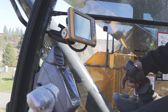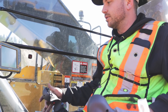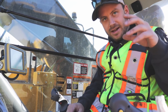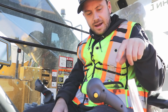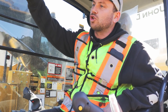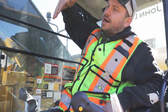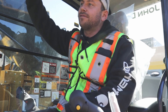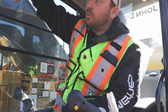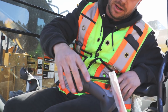You can hold down for the same — change different functions — so it gives you six software quick features. Underneath there's a blue and a red button. Red button is for our offset, so we can offset our design quite simply — red will be down, blue is up — bringing that surface up or down depending on how much you want to cut. On the left joystick we have bucket control: when we're running automatic with bucket control on, whatever we set that bucket to as we reach out, the bucket's going to adjust with it and pull grade. With bucket control off, whatever we set the bucket to it's going to stay like that.